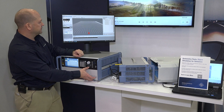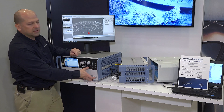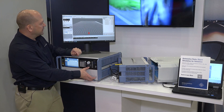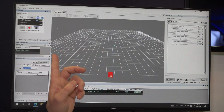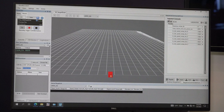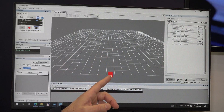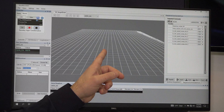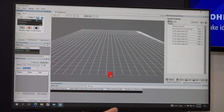Now let's go to the left-hand side. Going back to center, we can see a double reflection, meaning it's not tracking correctly. Moving back to center and then going to the other side, I can see that as I try to move the target to the left-hand side, it has dropped out of the sensor entirely. Going a little farther — now around 10 degrees — it still doesn't come back in. I have a clear issue: with the current settings, the sensor cannot see targets to the left-hand side.